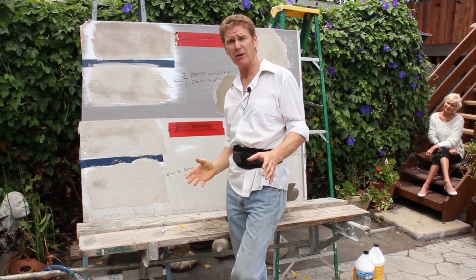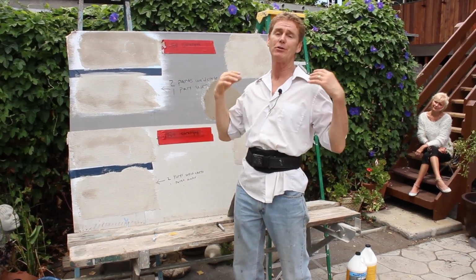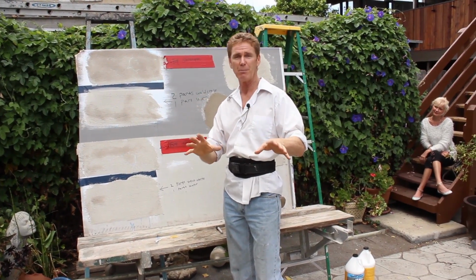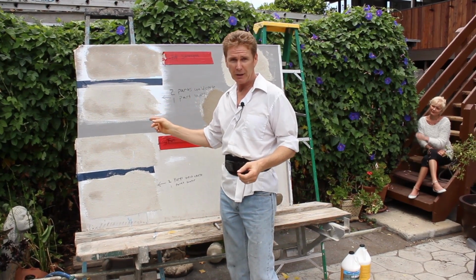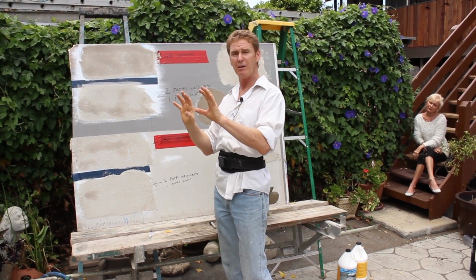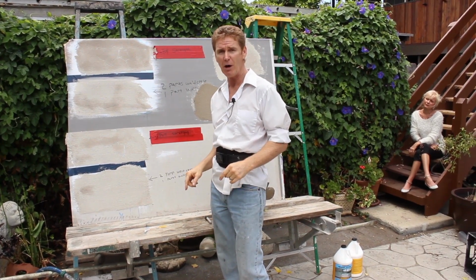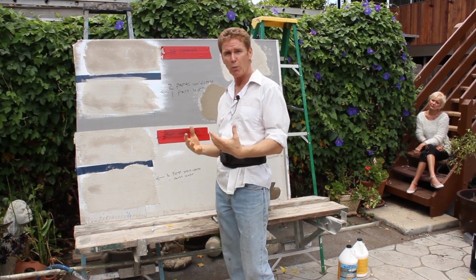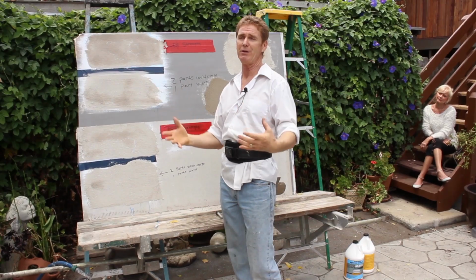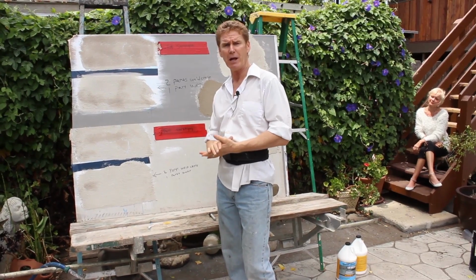And lastly, I'll just say that if I was Larson's or Weld Crete, I would not put in the description either as far as color coats. Why? Because of this, guys. Don't do what Kirk does, because I don't want anybody to call me and say, gee, I tried your method, it didn't work. That's not what this is about. If Larson's put dilute it, guess what? People would dilute it to nothing, or they wouldn't know the sealness of a wall. So you look at a wall and that wall is sealed. They wouldn't be able to determine how many coats of paint that has on it to determine the right amount of Weld Crete. So that's something that's kind of off limits for Weld Crete, and it's off limits with me too. But because somebody suggested I was trying to save money by diluting it, I thought, are you crazy? You don't save any money if you got to go back and redo a wall.